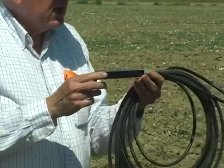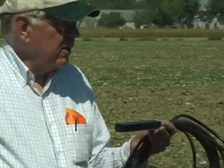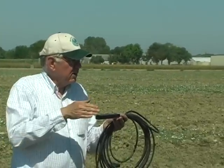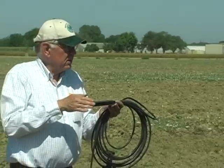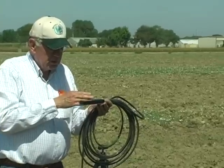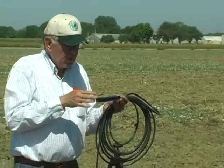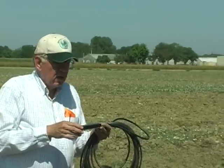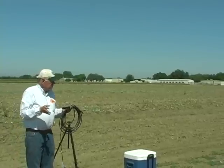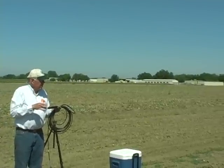What it does is it emits an ultrasound wave upstream, and that ultrasound wave gets reflected back to it. The frequency of the reflected wave depends on the velocity of the water. This sensor emits the ultrasound wave and then detects the reflected wave and determines its frequency. From that measurement, they've developed a relationship between the change in frequency between the emitted and the reflected wave and the water velocity.